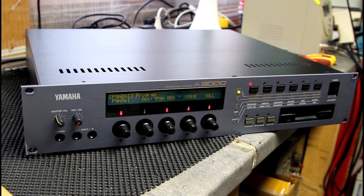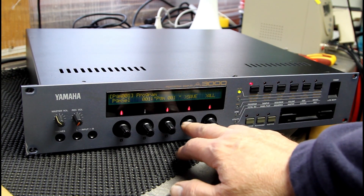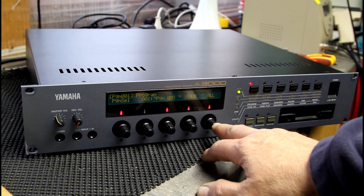Welcome back to the workshop. We've featured a lot of Akai samplers but this is actually a Yamaha A3000 sampler. I bought this as a spares-or-repairs unit — it does work and it's got a hard drive in it. The main thing is it's had one encoder replaced already which works fine, but all the other encoders are a bit intermittent, which is a common fault. We're going to take the encoder board out and replace them with new Alps encoders, the same make as the previous repair, so they'll all match.